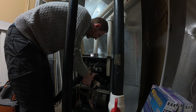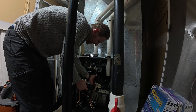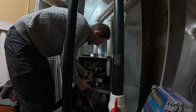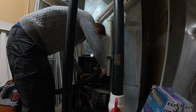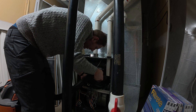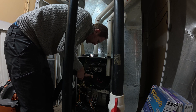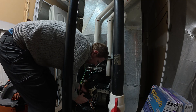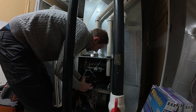I'm tipping it upside down to make sure I really get the water out. I'm also being careful because the back of this fan motor that hooks into the furnace has a gasket — a green gasket that goes around it — and there's also a plastic seal that kind of popped off when I pulled it off, so I made sure to put everything back together properly before turning the furnace back on.